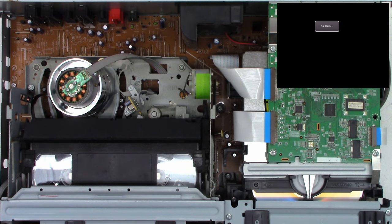These are Suscon, I do believe. I'm not seeing, these are Intercon, I'm sorry. Usually these are Suscon. Maybe the Intercons are better caps. Maybe they don't die as easily, but I typically replace these with Panasonic high temp 105 degrees Celsius caps, because I think if you look at these, they are 85 degree. Yes, you can see 85 degrees Celsius caps. So it's going to get replaced with a much higher quality cap that's going to last many, many more years.